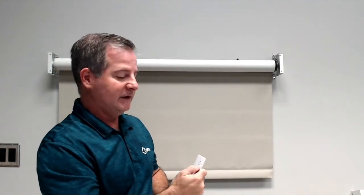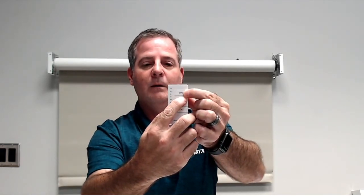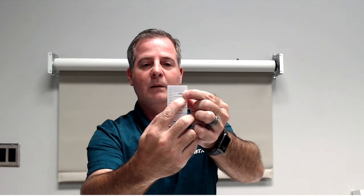Now, if you happen to make a mistake on this and you're like, uh-oh, I didn't want it on that channel, to delete a channel from the motor, all you do is, let's say we want to delete channel number 2, the one we just programmed, you're going to hit the stop and open button at the same time with the slow flash. So here we go. The motor jogs. Now if I try it on channel 2, you can see I'm on channel 2 here. It does not operate the shade. So that's how you actually delete a channel.